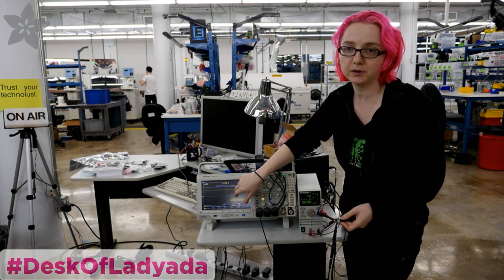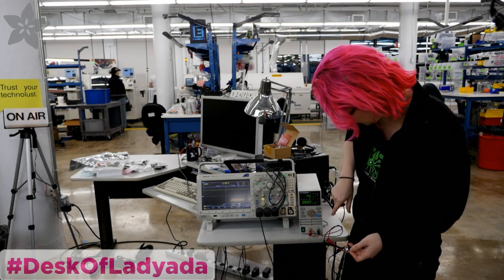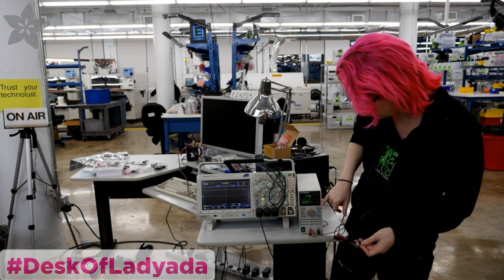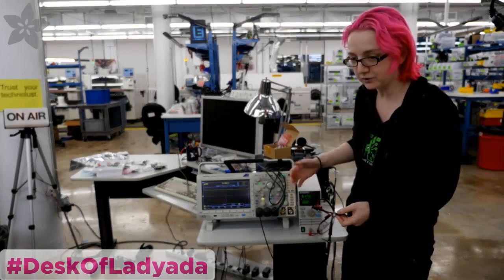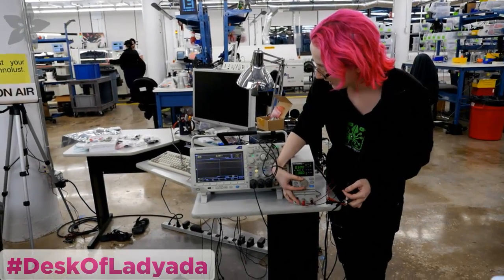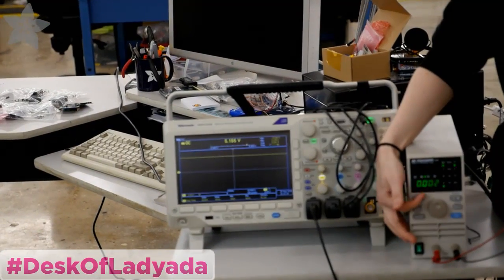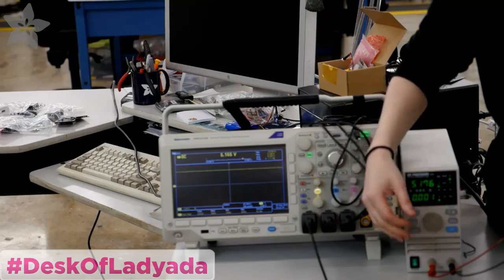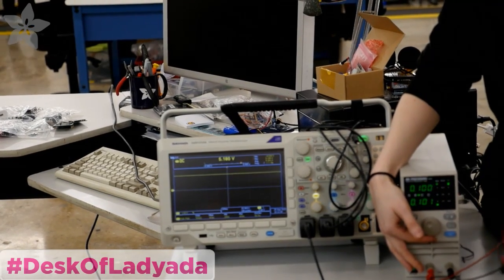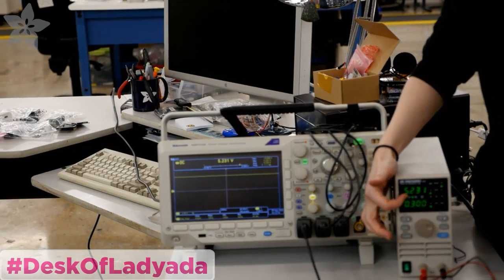If you want to see ripple or spikes and measure the peak to peak, you really want a sense — I like looking at the oscilloscope at the same time. So you crank this down to zero amps and you turn it on. Right now basically nothing's going on because it's not drawing any current, but then you can turn this up 0.1 amps at a time. What's interesting is as I turn it up, this voltage is actually increasing a little bit. Starting at zero amps I get 5.15, and then at 0.3 amps I'm up to 5.25.